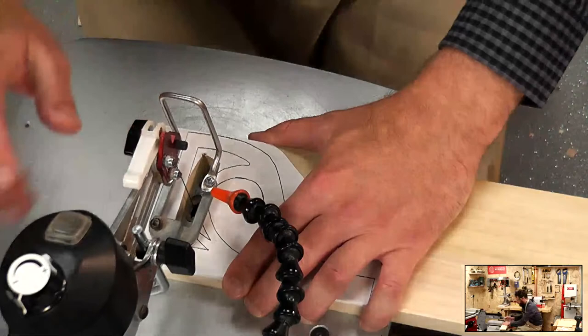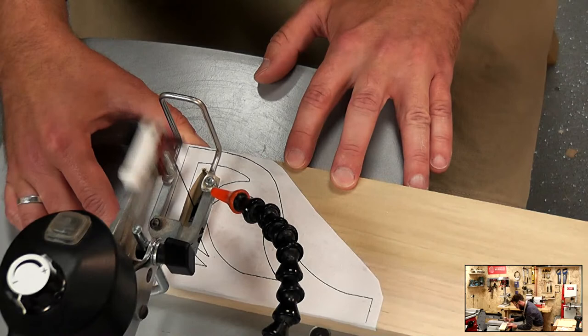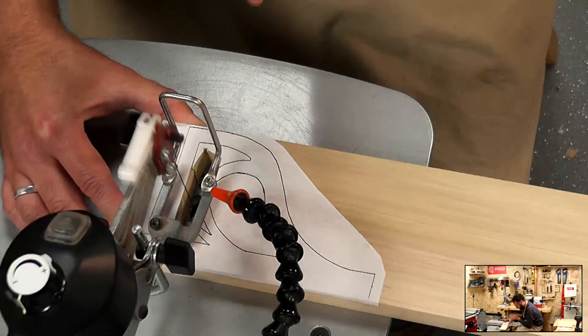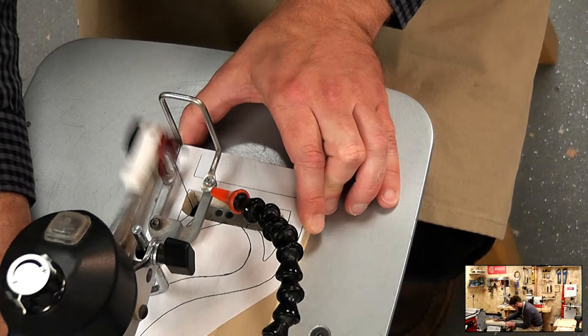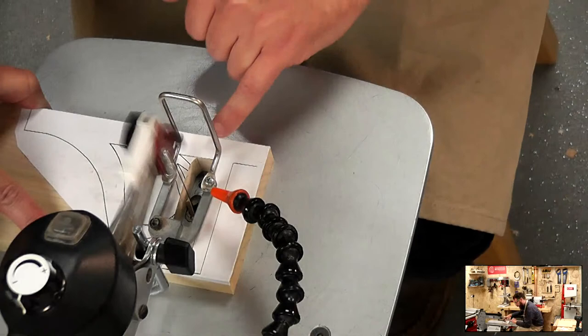So just checking my tension there, resting the blade up on the side of the project. It's not actually cutting until we get to that section we're going to cut into. Sometimes when you start a cut next to a flat you've already made, you'll get a little line, but we can come back and sort that out with a different tool. I'm going to trim off all these little corners. Sorry, I went the long way around. By cutting up to the line, then sweeping out from the corner, and then coming back and cutting it, you'll get a much cleaner, squarer corner.